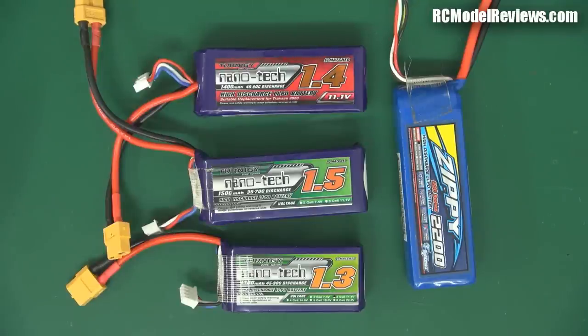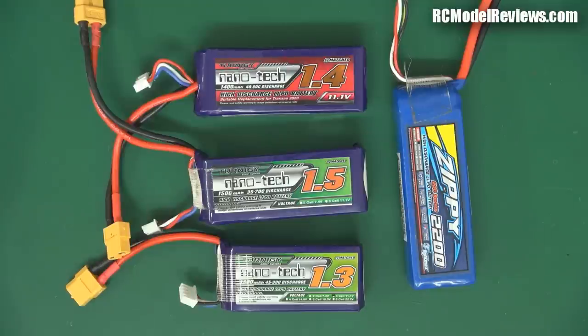When I fly mine, I usually set my battery alarm voltage to about 11.2 volts on a three-cell pack. That gives me plenty of flying time - I can get five minutes flying time like that. When I land, my battery usually comes up to about 11.4 volts, which is storage charge. So at the end of the day's flying, I throw my batteries in a bag and go home. They're not over-discharged and they're not overcharged. They're ready for me to recharge whenever I like. If I don't go flying for two weeks, that's fine - batteries on storage charge will stand up really well. If you store lipos flat they will puff and fail. If you store them fully charged, eventually they will puff and fail. These are not designed to be stored fully charged or flat, and if you do so you'll end up with dud batteries.